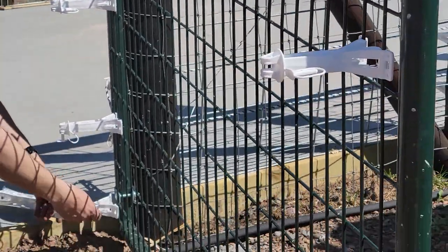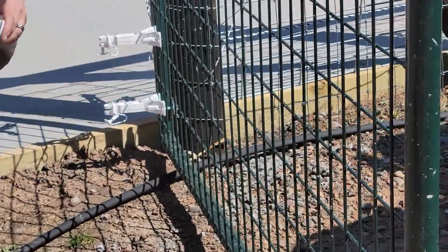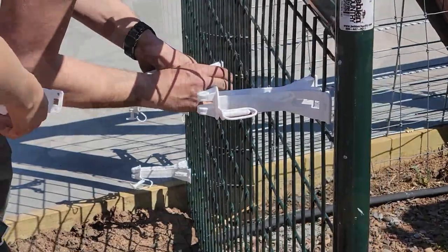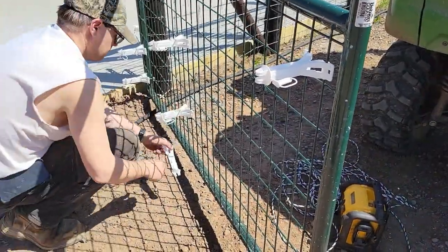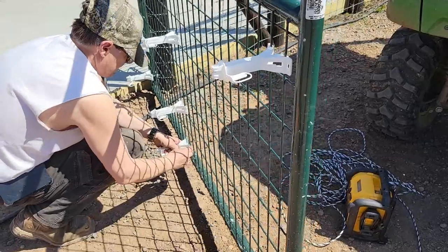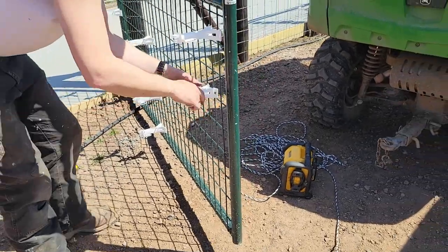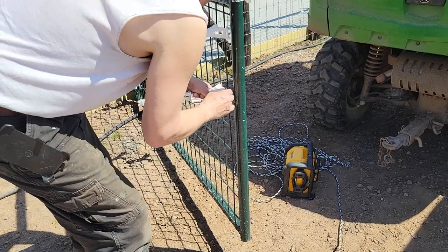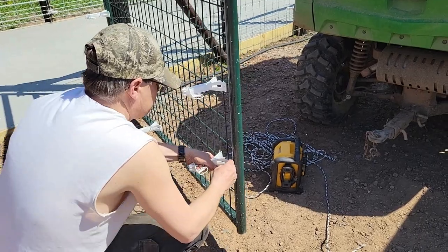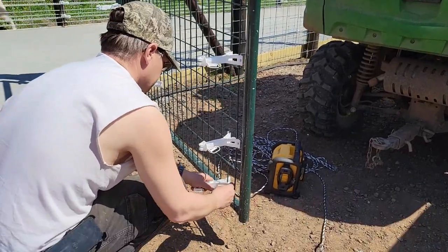Right now I'm just figuring out the spacing. I'm going to put the bottom one about four to six inches up, the next one at 12 inches, and the next one probably 18 to 20 inches. I don't have to run these quite as high as the other gates because they're piggies. I really want to just stop that snout from trying to get under the gate and lift it. To stop it from lifting the gate I put the top hinge pointing down and the bottom hinge pointing up, so that locks it in place. I've seen what these pigs can do to a gate at the neighbor's places.